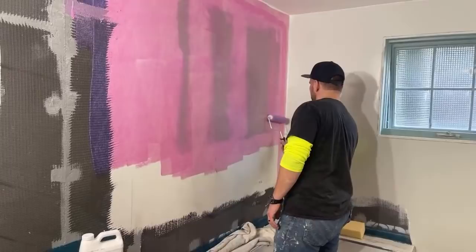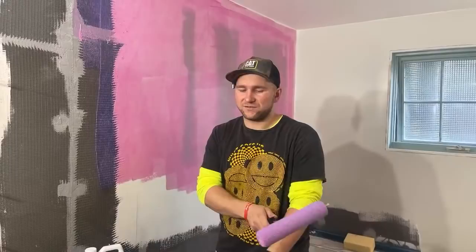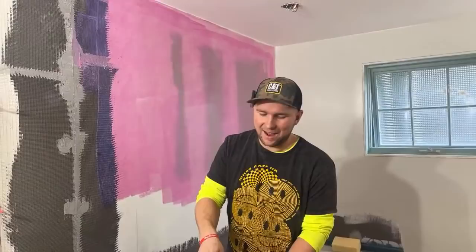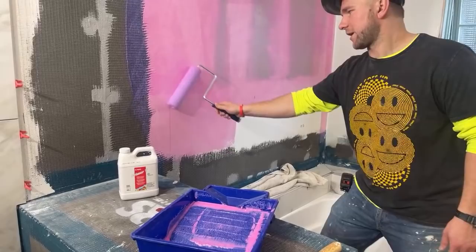How often do you do a dry pack floor? What can you do if it dries wavy? You could mix some thinset and then kind of compound it, I guess. Just smooth it out with thinset. I think that's how you can do that. Let it dry, put a fan on or whatever, and then if you're using mosaic, you can go back over that. So use thinset over that. It'll be okay.